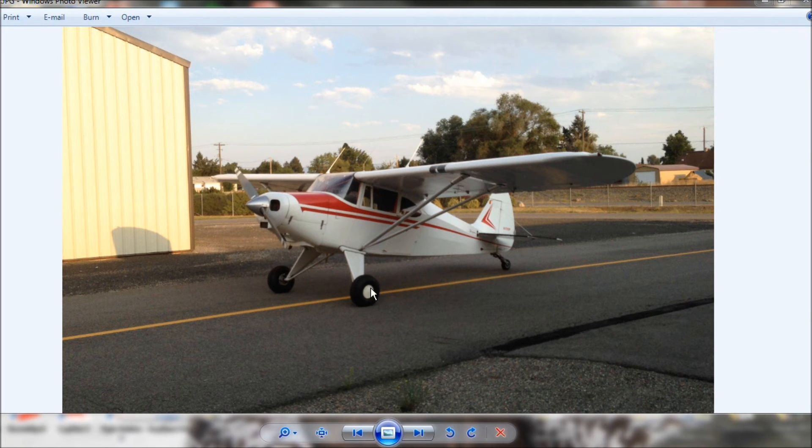After I took this picture, I wrote the N number of the aircraft and noted that it was measured in U.S. gallons. I also noted that it was in three-point attitude only, on level ground, with the 806 tires that were on it — so I would know the configuration it was made for. If I had put huge bush wheels, skis, or floats on it, the attitude of the aircraft would change, so the markings of the dipstick wouldn't be valid anymore. It's really important to note those indications on your dipstick so you know what attitude the plane was set up for when you made it.